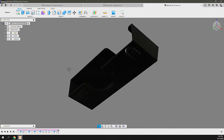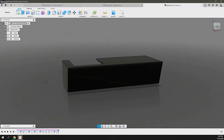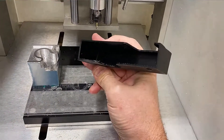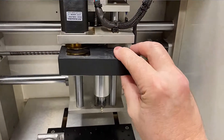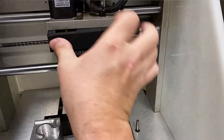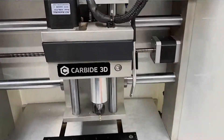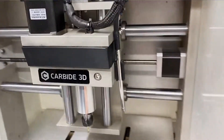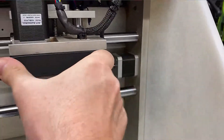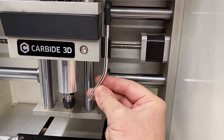The next upgrade was adding a dust cover to the motor drive and pulley, which helps reduce noise and dust accumulation in that area. It was modeled in Fusion 360 and 3D printed on the Taz. The model incorporates a couple of tabs that snap-fit into place when pushed onto the spindle. It finishes off the machine and adds some aesthetics while keeping things clean. You may also notice the air nozzle mounted on the spindle, which incorporates a small 12-volt pump and air line routed through the drag chain to help with chip clearing.